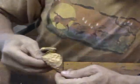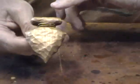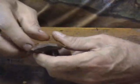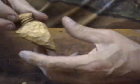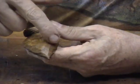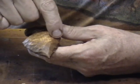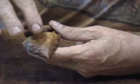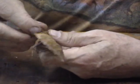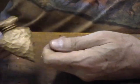Now, look at that. Almost looks like it's made out of stone, doesn't it? And see here where the end grain shows, here on the end, how much darker it is than out here on the front. That's why it looks like it's been chipped. See, because every time you take a chip, you expose a little bit of the end grain and also a little bit of the front of the grain, so that the end grain is darker than the front of the grain, and that's where you get those chip effects. And I think that looks pretty slick.